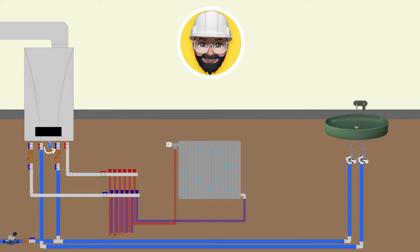Secondly, we will need to fill the closed cycle heating line. To do this, we need to open the blue-colored valve under the boiler. After the valve is opened, the clean water from the city network line passes through the boiler and starts to fill the heating system.